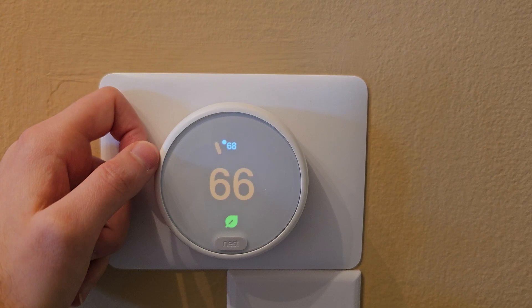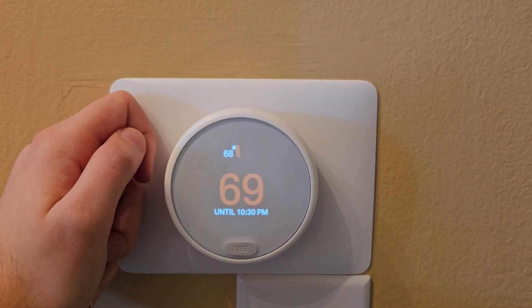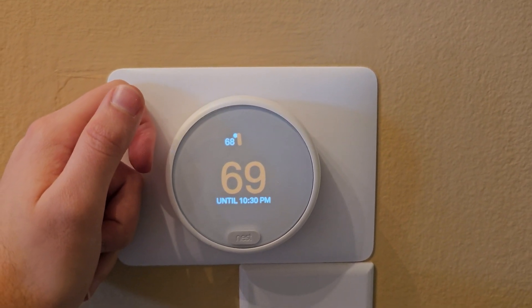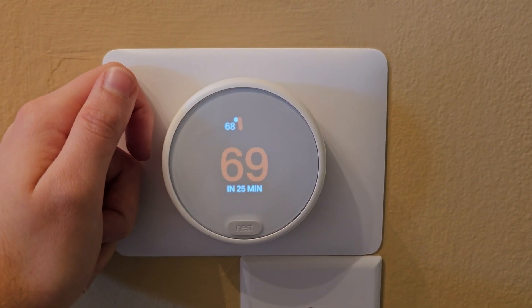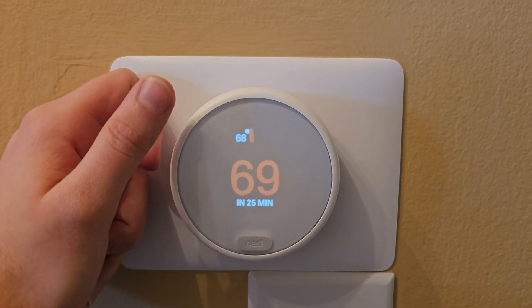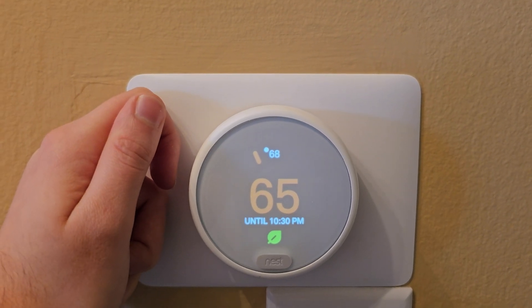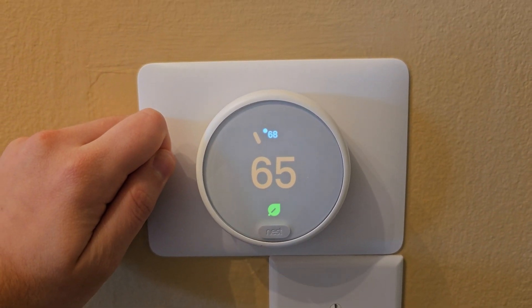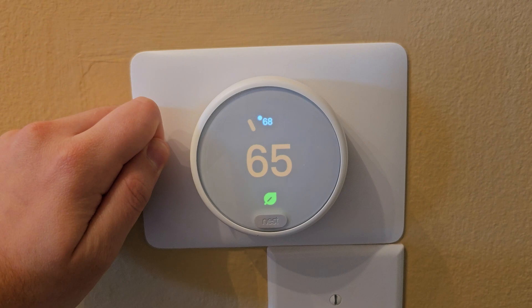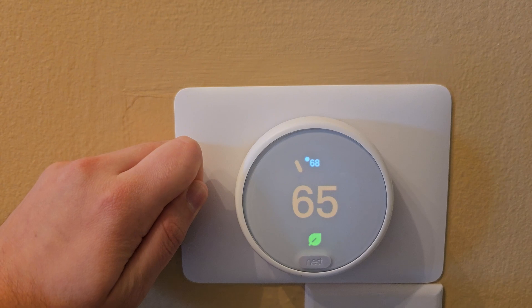You can test it real quick by turning on the furnace, and your fan should automatically kick on with it. It will not wait a few seconds like normal — it will automatically turn on. If it does not turn on, automatically shut this off because you do not want it running without the fan. If you're smelling smoke or anything like that, or the fan is not kicking on, make sure you turn your furnace off and see a technician.